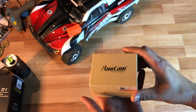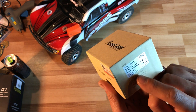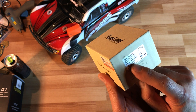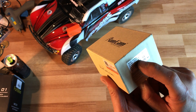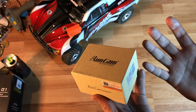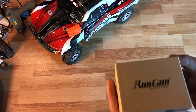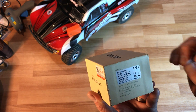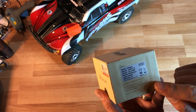There are a couple of changes for the better. The sensor is IR blocked, and I have a 2.3mm lens, which is going to be a little bit different. The power is DC 5 to 36 volts. The 5 volts is actually a lot lower than what some of the other cams run on. The reason that's helpful is that if you're running a battery pack down to its lowest portions, your video will not cut out.